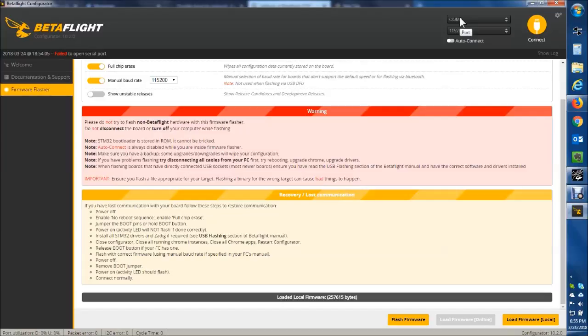I just want to draw it to people's attention. What happens is I can connect to flight control software with the Omnibus boards, but when I go to flash it, I hit a roadblock because I can't get DFU mode to come up as a port — it should come up as DFU once you switch into it. It won't, and then I get a failed COM port.